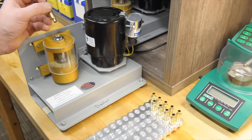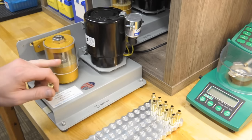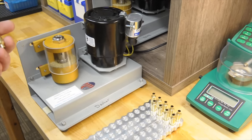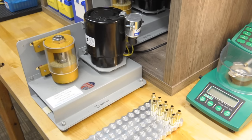This takes no time at all to do, especially once it's been trimmed to length to what this is set up at. These come setup from Giraud, which is really nice. You might have to do a little tweaking to get it to touch your brass initially, but the cutter head itself you order per chamber. They basically set it up and even send you an example piece of brass that they cut to show you how it was set up. Super nice tool, well worth the money — I have one for .308 and one for Dasher.